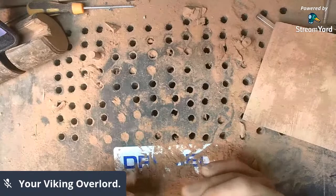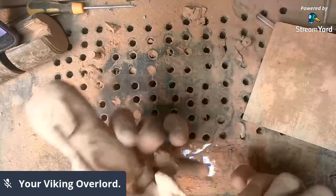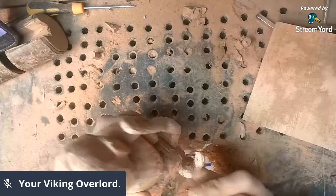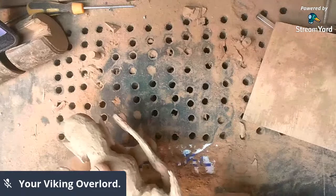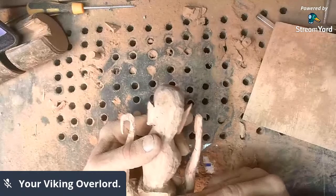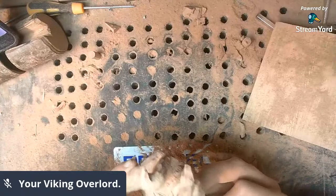It's a bit difficult to explain. It's like a flat base with an L shape and a bar running through it. And the L shape goes up towards the headstock, doesn't it? On the bedways. You have one piece of wood on the bed that goes to the end of your jaws. If you go vertically down from your jaws, that's where that piece of wood stops. Then you have another piece of wood in the bedways that has a vertical piece with the dowel bar going through. You push that up against the bottom of the inside of the bowl and look down, and the space between the piece of wood at the headstock and your depth gauge shows how much further you've got to go till you get to the bottom of the bowl.